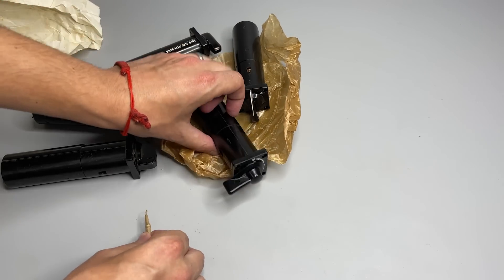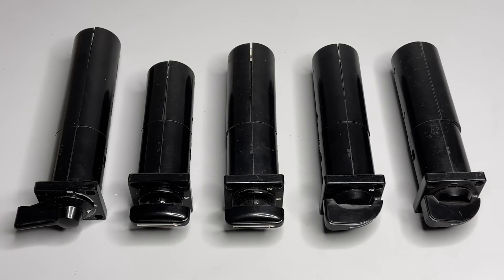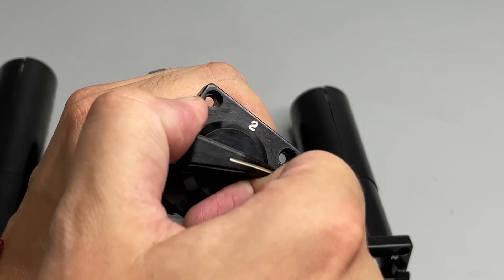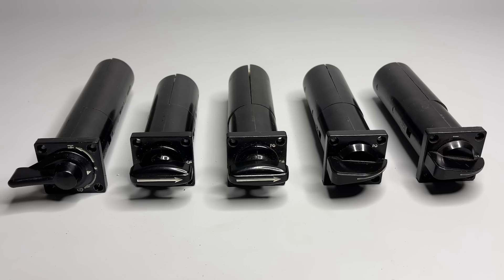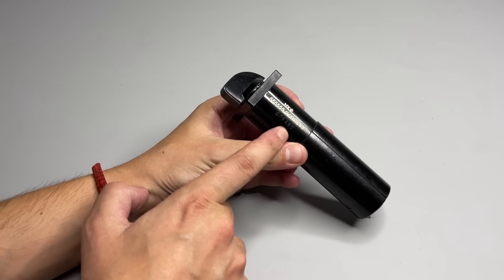That's because at nuclear power plants one switch typically has to simultaneously connect or disconnect many circuits at once, which requires numerous contact groups installed inside. Some switches have multiple positions, some have fixation when turned, and some have auto-return — allowing you to activate them only for a short time while holding them in your hand. It is also possible to adjust them, making many variations. Let's take a look inside this very switch, which is pretty much the same as the AZ-5 emergency shutdown switch.